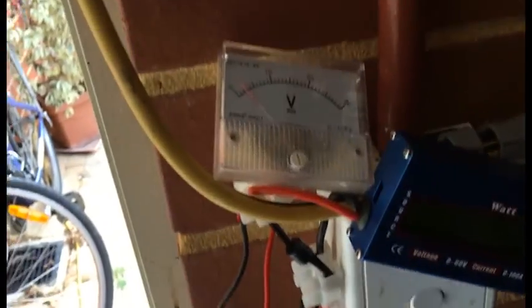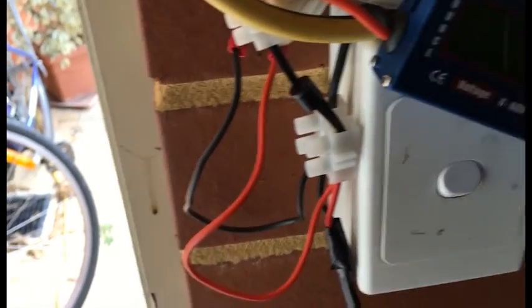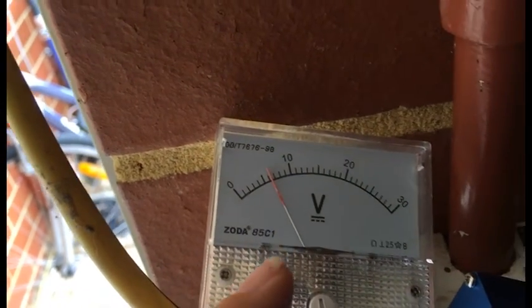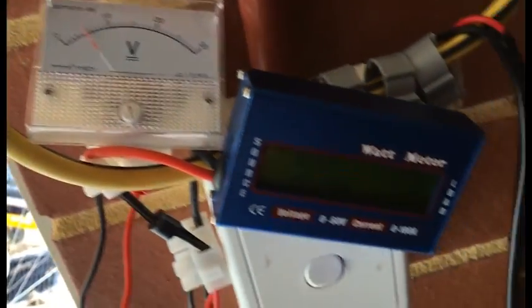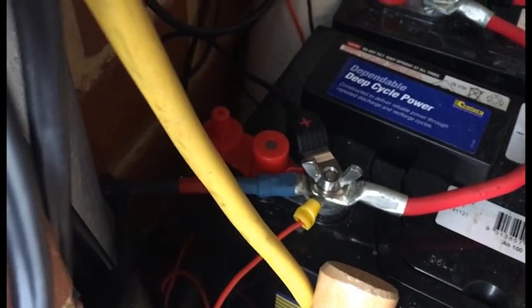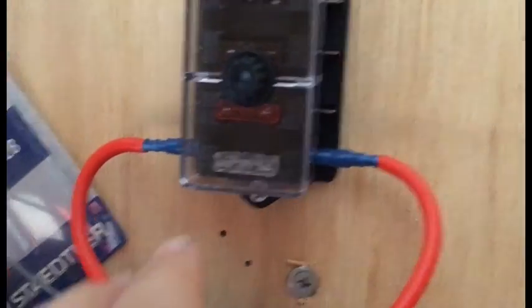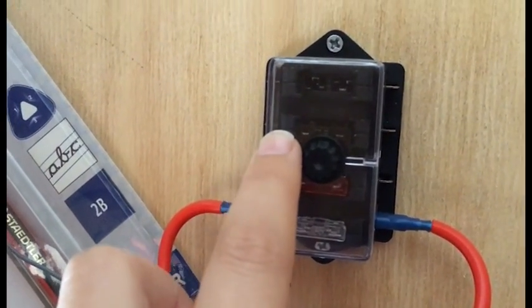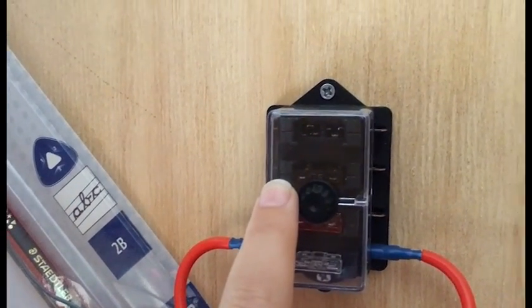My wind turbine comes up through here, and this is a blocking diode so the voltmeter won't read the battery. From there it goes into this controller, and then straight into the battery. I'm going to be hooking up a fuse for it — I've basically got the fuse board, I just need to wire it up. The first fuse is for the 190W string, the next one is going to be for my car stereo, and the next one is for the wind turbine.